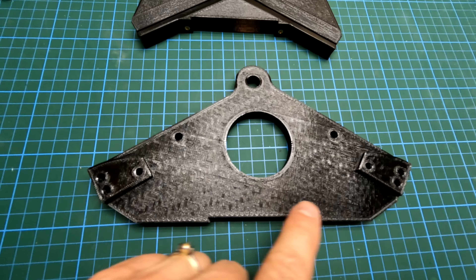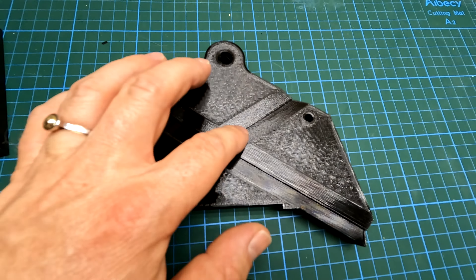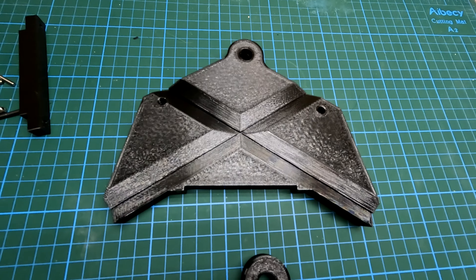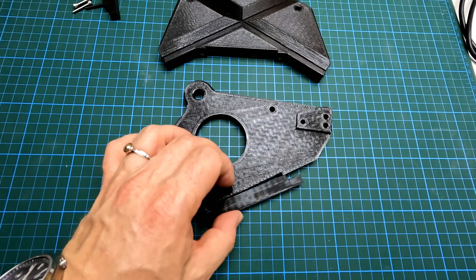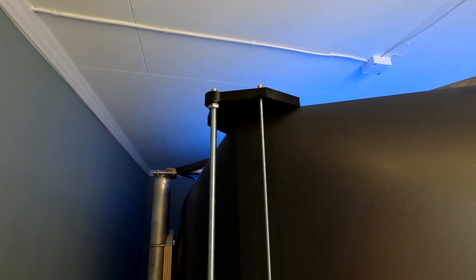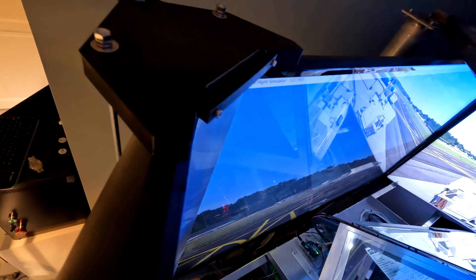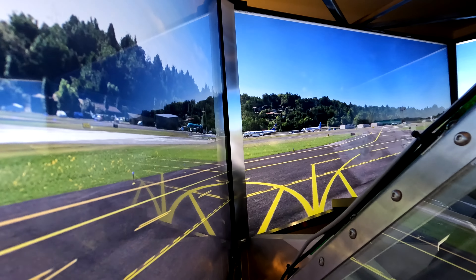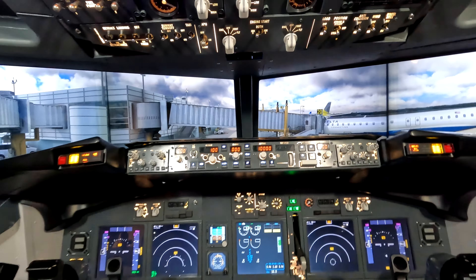After a lot of trial and error and plenty of prototypes I have arrived at a design I'm happy with. The lower brackets have holes for screws that mount to the TVs. For the top brackets I designed grooves that match the TV bezel contour, which restricts TV movement when clamped down. The lenses are held in place by simple clamps. The top brackets are held in place with a combination of two M5 rods in tension and one M10 rod in compression, putting a significant clamping force on the TVs and keeping everything fixed.